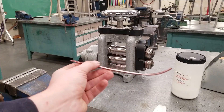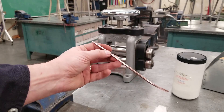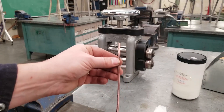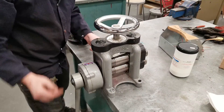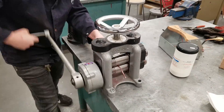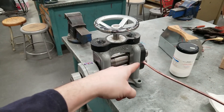Look at that — see the length? It's starting to really get a lot easier to work with. I'm still not quite sure what I'm going to do with this when it's done — I could bring it down into tiny pieces of wire and make some simple wire jewelry, or maybe flatten it out and try to turn it into a ring. I think we'll try the ring first. I'm going to keep on rolling it and stick it through the flat rollers, then move it over to get a flat surface with a small curve on the other side.